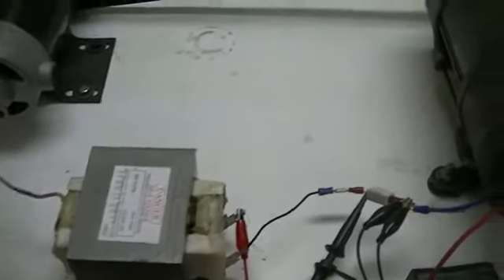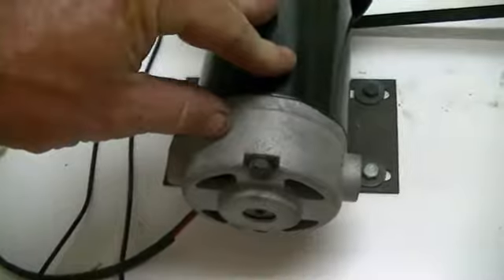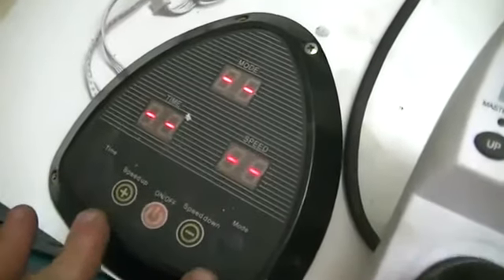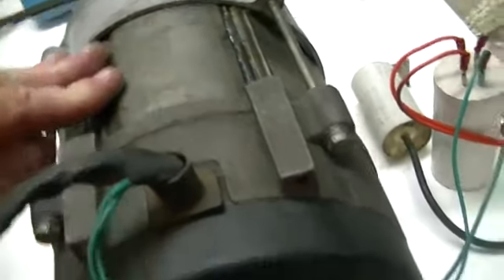Big hello to everybody. What we're going to be looking at tonight is this reactive circuit that's run off a generator. Luke has been working on and doing a fair bit of work on. This is similar to his original setup. I do not have my motor direct-coupled to the generator — I'm using a belt, which makes it easy to change motors. This motor is a 180-volt DC motor with a speed controller, and we have our control panel and our watt meter. The AC goes into our speed controller and is converted to DC pulses which go to our motor.